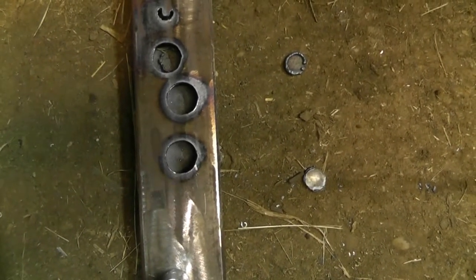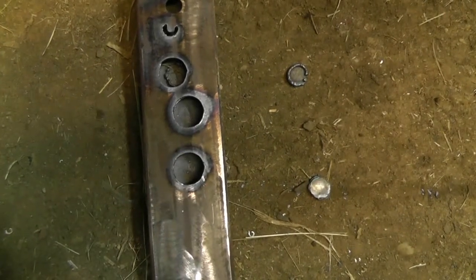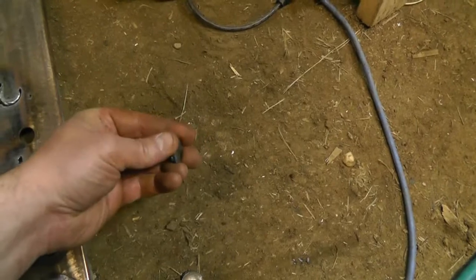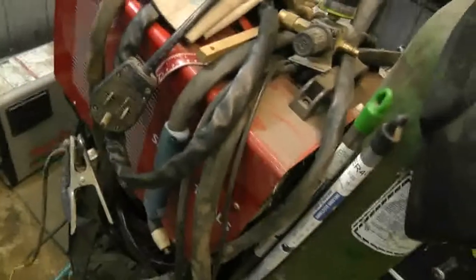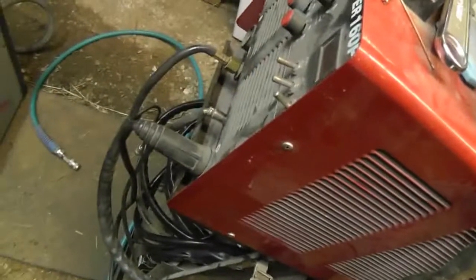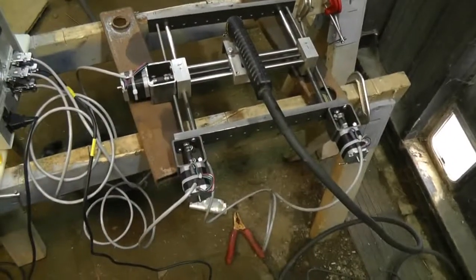Anyway, a circle is probably the worst case scenario for backlash. When you're cutting a rectangular bracket or hole it might be a little bit shorter or longer, but not as noticeably off. You can see there's actually a fairly wide burn width on this thing — it's almost 100 thou. In danger of making this a really long video, I'm going to cut it off right here. It looks like it's working reasonably well, but it's going to be pretty crude cuts. Ironically, the thicker the steel is probably the better cut I'm going to get, because I really should be going a lot faster. You can see there's a fair bit of dross on the back from the cut. If I was going faster the cut would be a lot narrower. That's one reason I would have preferred to use the lower amp unit, as it seems to work better for thin materials. Anyway, that's it for today guys, thanks for watching — work in progress for sure.